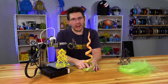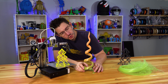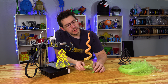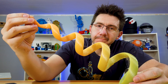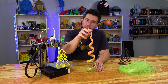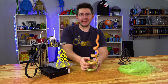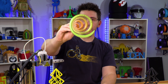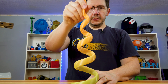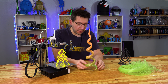This is the impossible tree. Granted, I changed the rules a little bit because I scaled X and Y not the same as Z — and that's fine. The quality is good. You can tell with the rainbow filament we have kind of a green down here, going to an orange and a peach — almost looks creamsicle-esque. I can tell there are some layer inconsistencies in certain parts. After viewing the time lapse footage, it looked like the sheer weight of it bent it down just a little bit as it was printing, but not enough to make it fail. It's a little stringy in there, strings going all the way to the top. I did 215°C on the nozzle to get it nice and hot. The Asta filament did a fantastic job — the texture, the color, it looks great. If you want to try that filament, I highly recommend it.